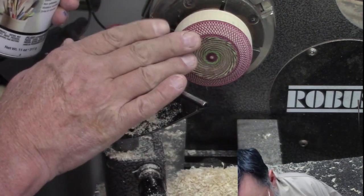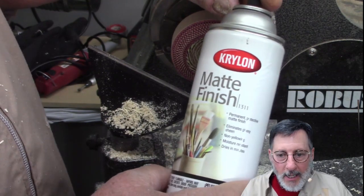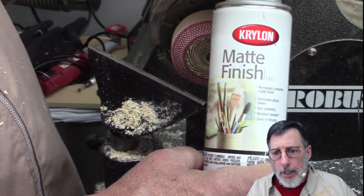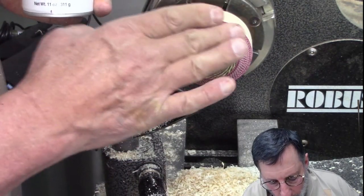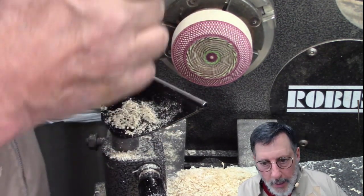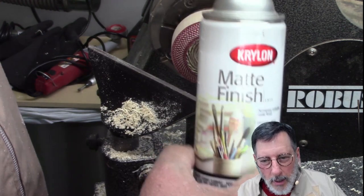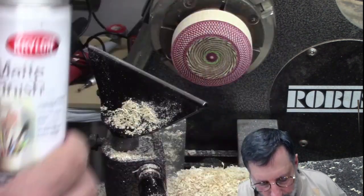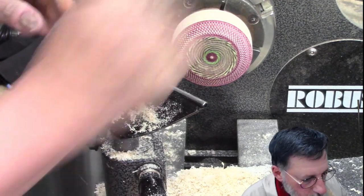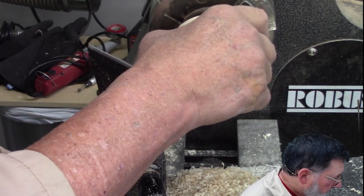Okay, and I won't spray right now, but what I do on top of that, I'll put a lacquer. I could start with a shellac, but that tends to put too much color into the wood. If you rub on a friction polish, you probably get some bleeding on there. So it's a good idea to spray something on like that, or an acrylic lacquer, or just a regular lacquer. Okay, I'm gonna transition here into something else,